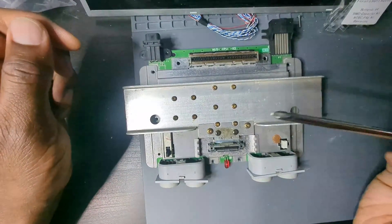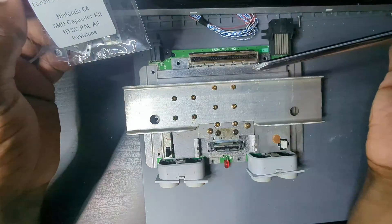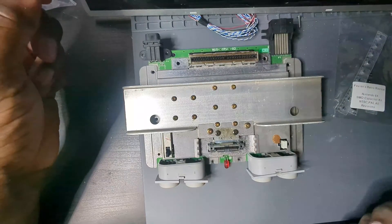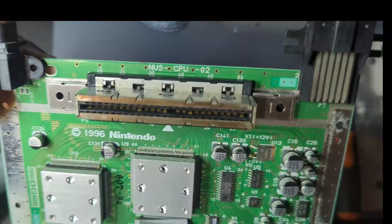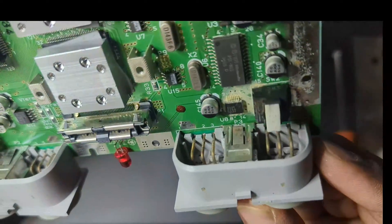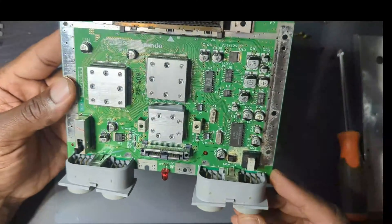It's just from eBay. I'm going to take apart this and see what we're doing underneath it. There are different kinds of Nintendo 64 motherboards, so there are different capacitors, but this kit pretty much has all the stuff for all the different versions, so you just pick what you need. Here's the motherboard — not sure how many versions there are, there are quite a bit. It looks like I've got some sort of something going on over here but we'll clean that up. Pretty much all these electrolytic capacitors are going to get replaced.